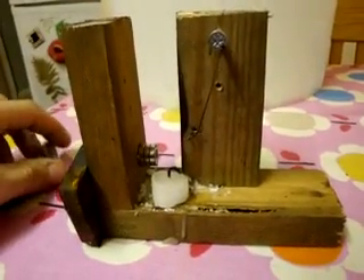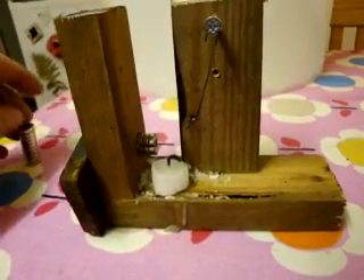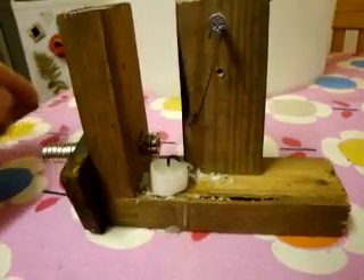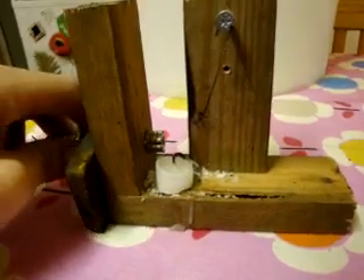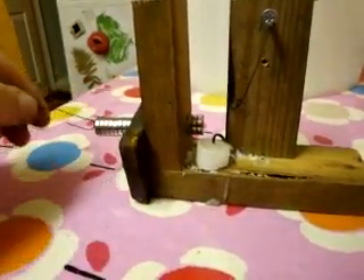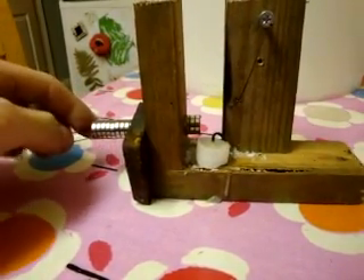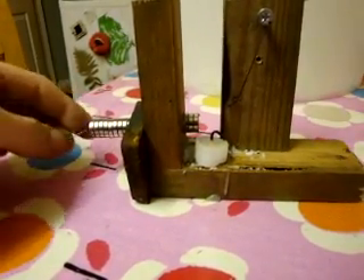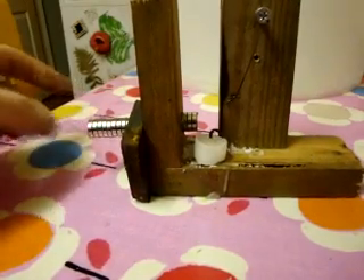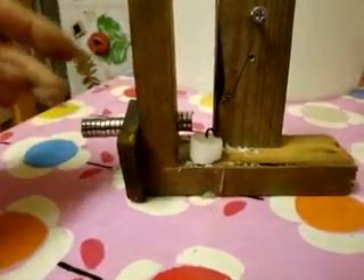I think this is quite an interesting property of metal. Because I was using the forge, it's a property you use when you're hardening stuff. What you do is you heat the metal up — you see at the moment this is magnetic. Once you heat it up, it's not magnetic. If you want to harden some steel, you heat it up until it's no longer magnetic and you just quench it. And that's basically how you harden stuff.